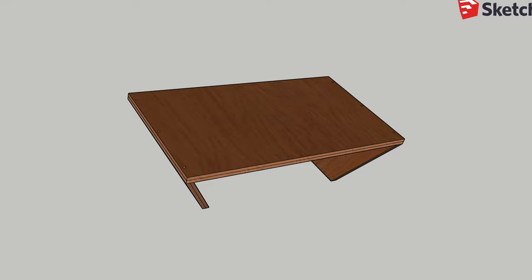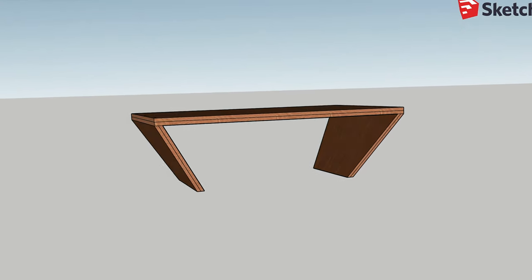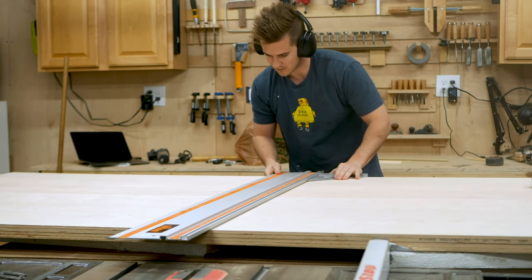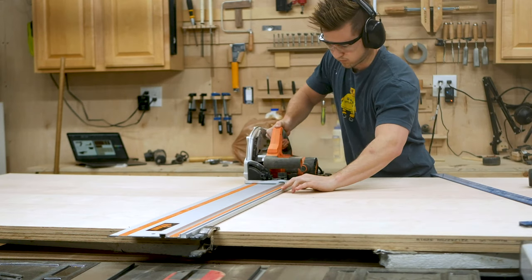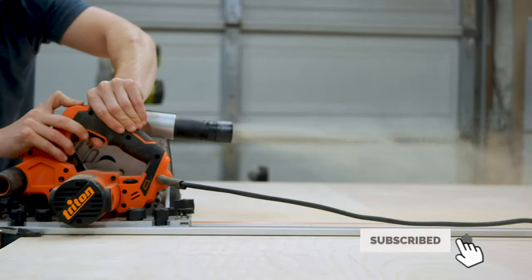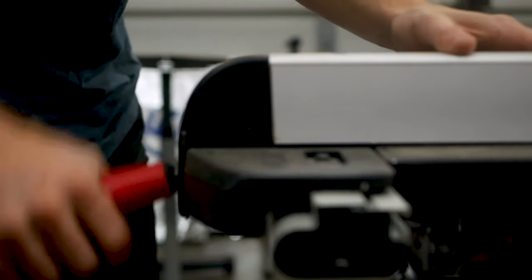The design of this piece called for everything to be double stacked plywood, both for design and for rigidity. I began the project by measuring and ripping down what would later become the top part of the table, ripping both pieces at the same time, clamping them together and first using my track saw because my table saw simply couldn't cut something this large.